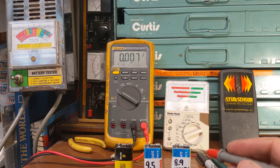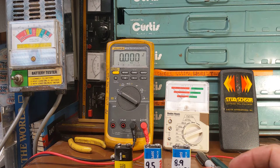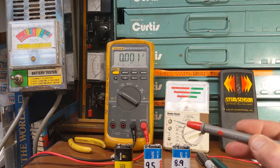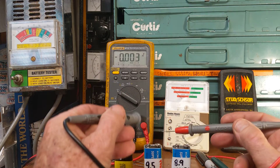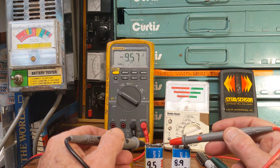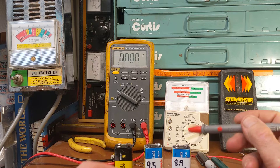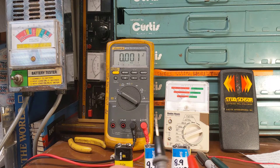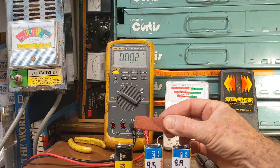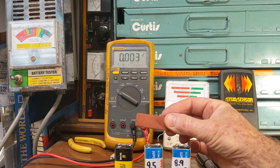Fortunately I had the sense to double-check my battery voltage, but in this case I checked it under load, and I found out that I was misled by checking the battery with my multimeter. Here's a multimeter — if I put my probes across here, I've got about 9.5 volts, and yet when I put a load on it, it drops way down. In fact, I tried putting a 1,000 ohm resistor across there, and that 9.5 volts dropped down to 2.9 volts.